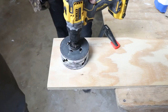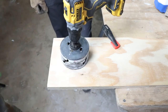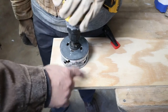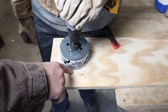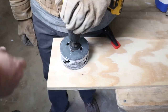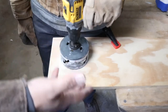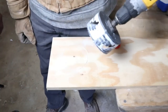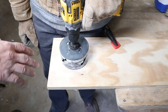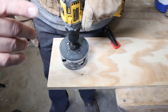There's a lot more chance of kickback going into plywood — the bit jamming and twisting — so you've got to be more mindful of hurting your wrist. You're going to want to lock that up into your body. Now, if this was a surface you were really concerned about tearing out, you would run the hole saw backwards just enough to cut into it a little bit, then switch to forward. Harley's already done the backwards for about 20 or 30 revolutions. Now he's going to drill a good way through, then we'll flip the plywood and finish drilling on the backside to prevent tearout.